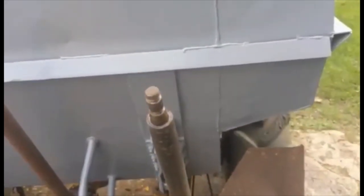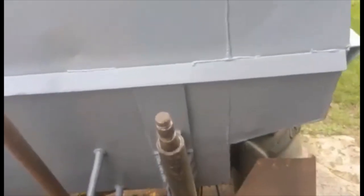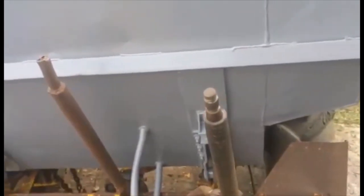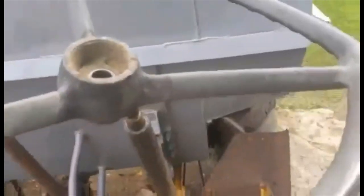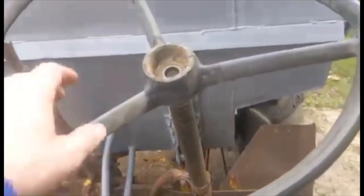When the steering wheel goes on — it goes on nice and tight — the Ferguson steering wheel actually has a keyway in it, so I'm going to have to put a keyway in this shaft as well, then hold it nice and tight, put the nut on top and tighten it all down. I want the steering wheel to look right — a modern one is just a big plastic blob that you get on modern dumpers. An old dumper like this shouldn't have a modern steering wheel. These original wheels are really difficult to find — I don't know whether it's a Bedford truck wheel or what.